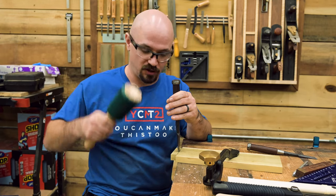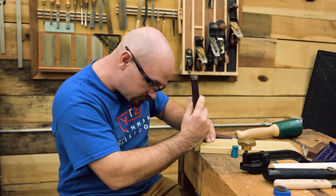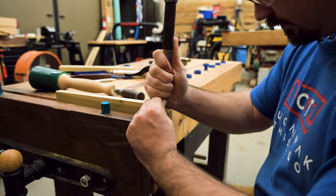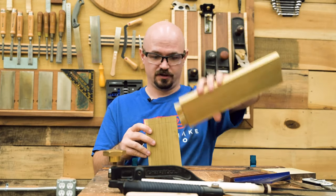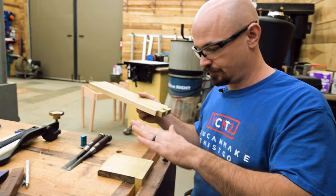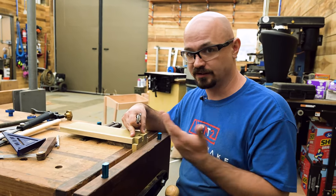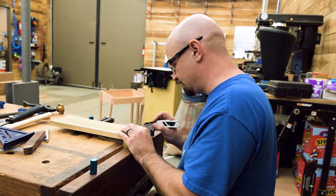So I don't have to worry about being perfect. Now while I have my chisels, I can also check my saw line and if I see any issues just smooth those out and clean it up. So I've established my baseline all the way around, and now I need to transfer this to the other board. An easy way to do that is to use an off cut as a depth gauge and lock this board in my vise. I'm using a spacer block instead of sitting on my bench because my bench isn't totally flat. Now here's where precision really counts — I'm trying to match these two surfaces. It really didn't matter much how perfectly I followed my lines before, because whatever it turned out to be is what we transfer. So I'm going to use my razor knife for a really clean transfer.